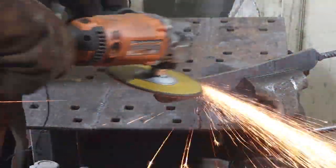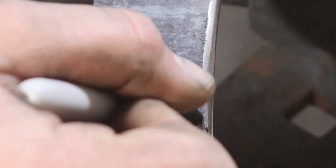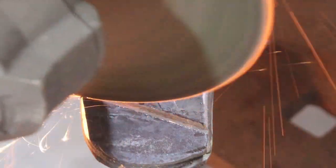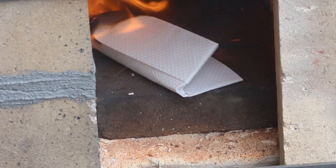I'm going to forge this down, so I want to make sure I get rid of any delaminations or cracks along the edges. I grind that down with a 36-grit metal grinding wheel, and then I use a 60-grit flap disc on the angle grinder to smooth it out — that way I can see any little tiny cracks. When you have a rough finish on there, you can't really give it a good inspection. We're going to lose both ends anyway since they never stick that well. So I cut this one at a little bit of an angle just to make forging in the tip easier, and we're off.